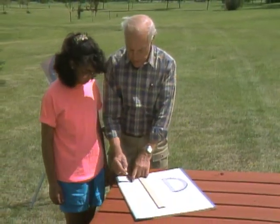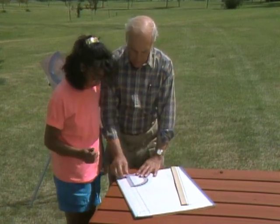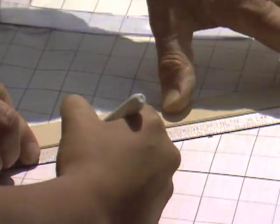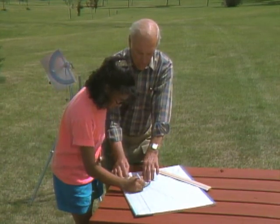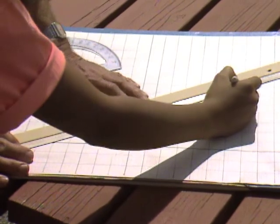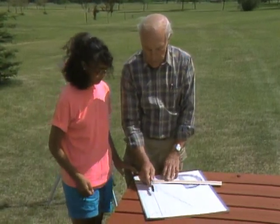Here are the two stakes. Each one of these squares is 10 meters, and the stakes were 20 meters apart. The measurement from the first one was 24. Take the pen and mark 24, then draw a line all the way across. Now the reading on the second one was 27. Now you know how to do this — how tall the tower is. If each one of these is 10 meters, how tall is the tower? I get it where they meet.